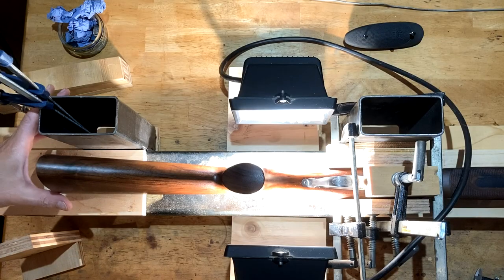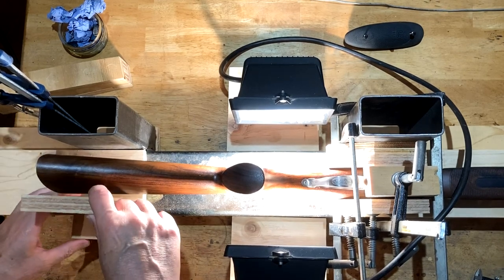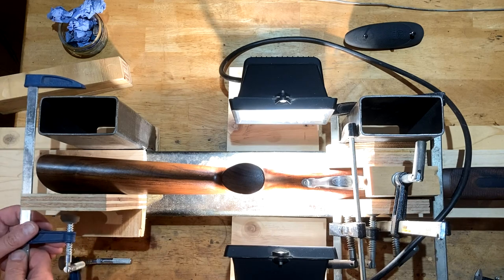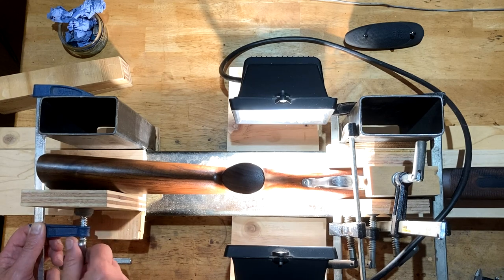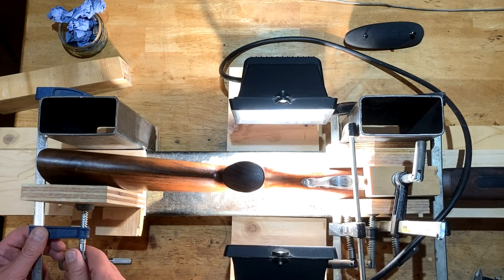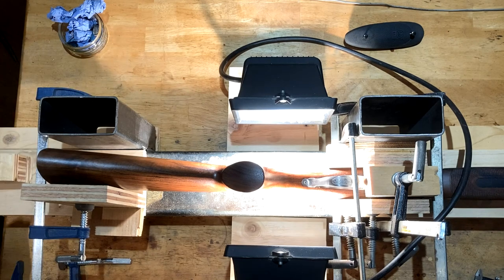Let's see if you can see this now — there's a bit more movement there, so we can definitely get some cast on. It's not an exact science — it's more of a case of doing about twice as much as you need. Each gun varies, to be fair. You can see now I'm putting on quite a pronounced bend on that, and you also need to increase the drop.